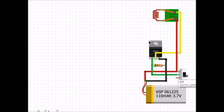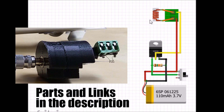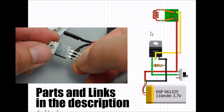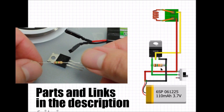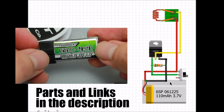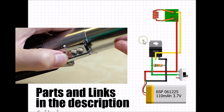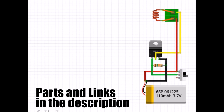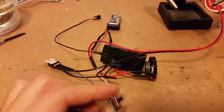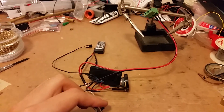Let's get started. Here's the schematic for the original burning lightsaber ignition system. This is a coil of nichrome wire in a terminal block. This is a logic level MOSFET with a 15k resistor. This is a small 3.7 volt LiPo battery, and this is the slide switch that was already built into the lightsaber. The switch can't carry the current needed to make the coil red hot, which is why instead I used it to turn on a MOSFET, which can handle more than enough current for our ignition coil.